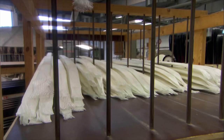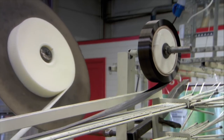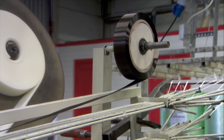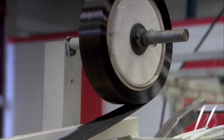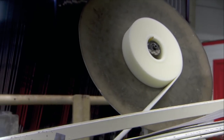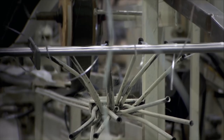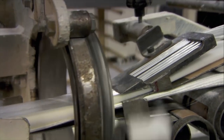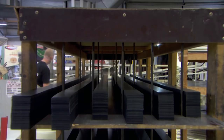First the outer cap is placed in the mould face down. Then the foam core is combined with two more layers of carbon fiber. This tape is only 0.1 of a millimeter thick, but carbon fiber is one of the world's strongest materials. Before it's placed on the ski press, fiberglass strands are wound along the core to add strength and stiffness. The all-important base layer comes last.